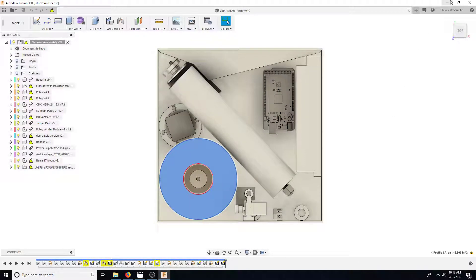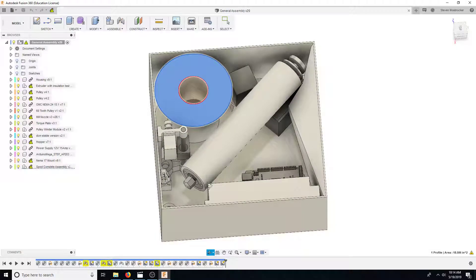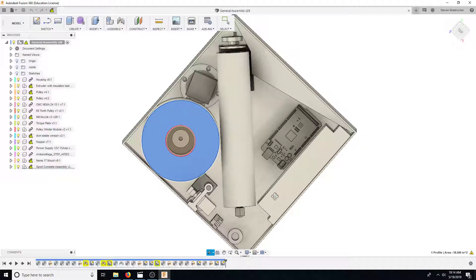Because we have such a high extrusion rate, we're going to need to snake the filament around to give it more time to solidify before it goes to the dimensional control. This piece here is hovering, so it will go maybe down here and around, go down here and around a little bit before it comes back over here — comes through this pulley and then goes up into the spool. We changed the spool design to use a similar design to what's on the test bench.